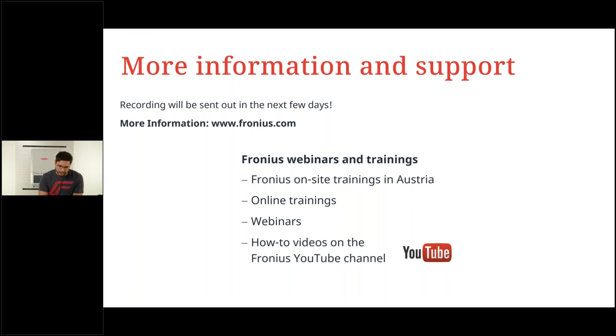So one question is about the startup voltage. The startup voltage is actually also the usable MPP tracker voltage. So we say 150 volts is the minimum in order to start the production in early morning. Meaning with, as mentioned, 6 or 7 modules, it is typically enough to have a Fronius Verto up and running. It is, of course, not the best efficiency, but it would work, no problem.